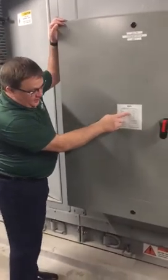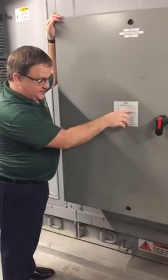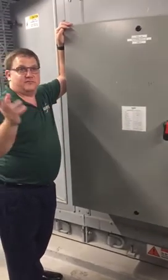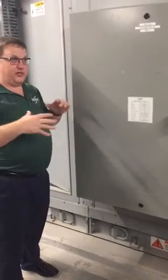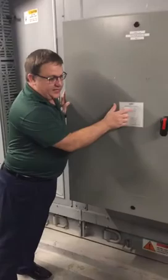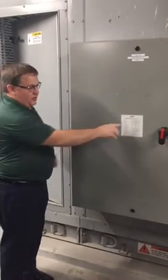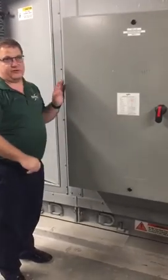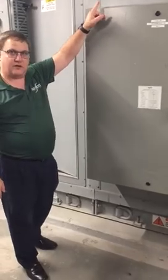Okay. Going from that, this is really an important piece: knowing the serial number for unit-specific information. The second portion is PJ48011. The PJ is Pittygene, the name of our plant in Arkansas. But the main number, 71572, is the order number. So 71572 will get us to this project. Now, not on every single one, and the reason is because this was phased. The first five digits get you to the generic project. If you need a specific unit call-out, that's what the rest of that serial number is for. Obviously you've got the voltage information and so forth. You've got a 60 horse and a 50 horse motor on this.